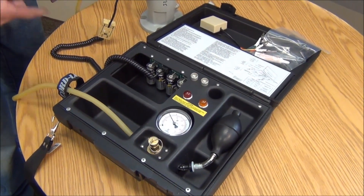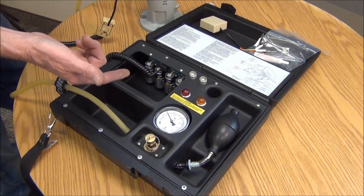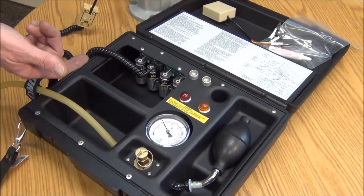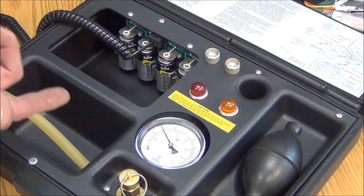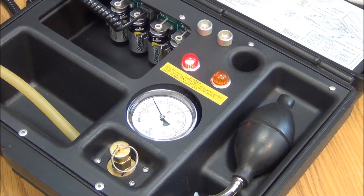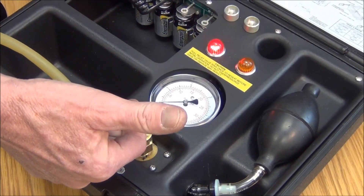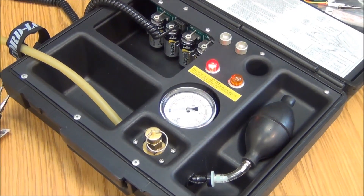This test kit also has a power-down timer. In the course of testing, if all of a sudden you don't have any lights, it's about a five to seven minute timer that powers down from the batteries to the circuit board — in that case you'd have to repress this button to power it back up. Right now I'm waiting for the red light to come on, which means the 60-second delay is done. I'm going to relieve the pressure — I do not want the yellow light to trip. Same scenario: I held it up, it didn't trip. This tells me with pretty good confidence this unit is calibrated within specifications.